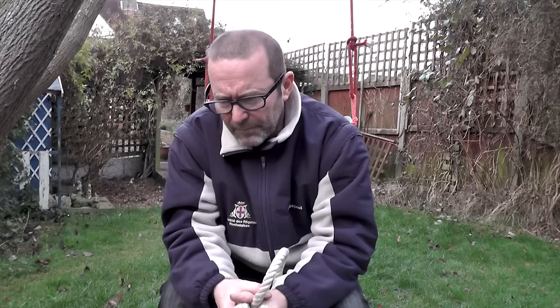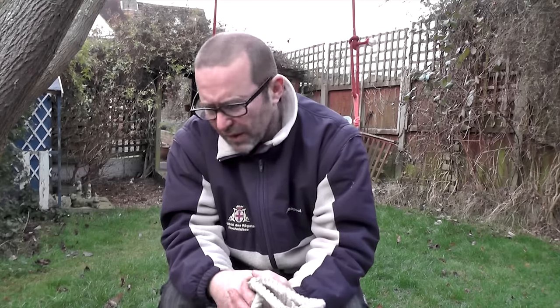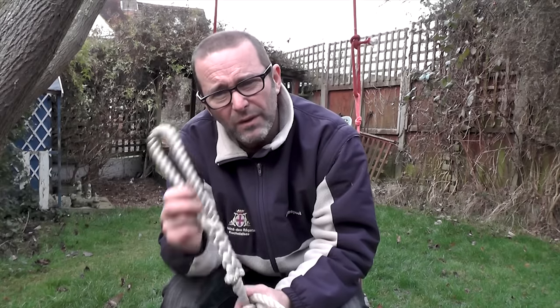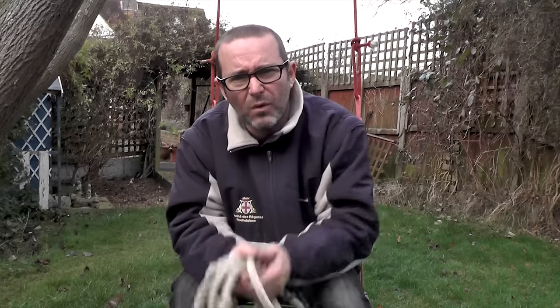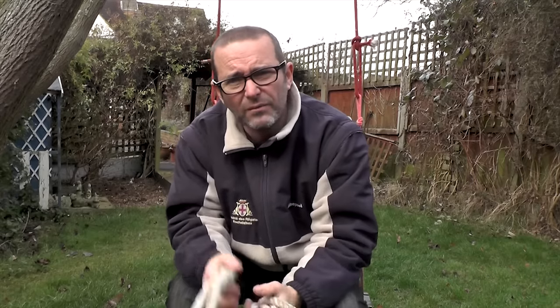When you're sailing single-handed there's a way around that problem. I go out to the boat in a dinghy, so I've got to do something with the dinghy — I tie it onto the end of one of my mooring lines, which both have spliced eyes in them. I tie it onto the end of one mooring line so it trails out behind from the buoy. When I come back I've got the length of the mooring line plus the length of the dinghy painter, which is deliberately made oversized, so the dinghy effectively becomes a buoy on the end of a big floating rope. It's easy to reach and gives me a huge window of error when approaching the buoy — I can snag the rope on the dinghy, heave it all on deck, and then hook my spliced eye straight over a cleat.